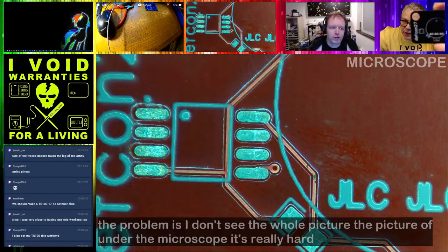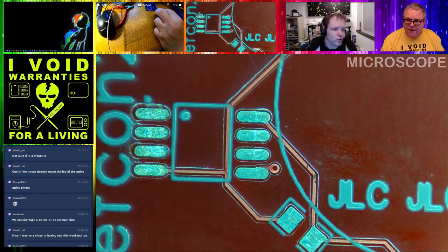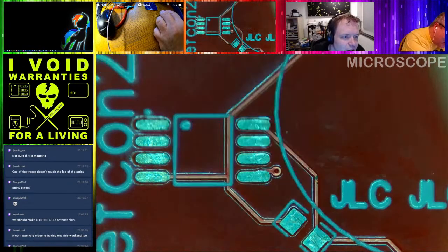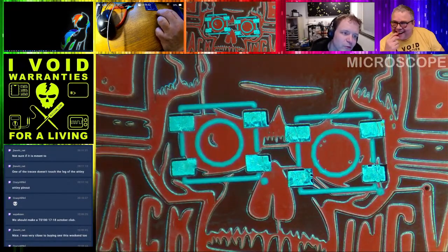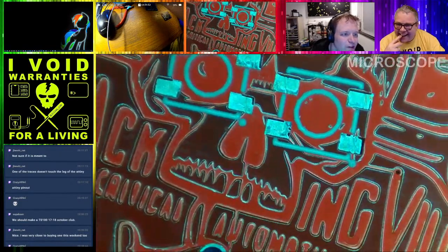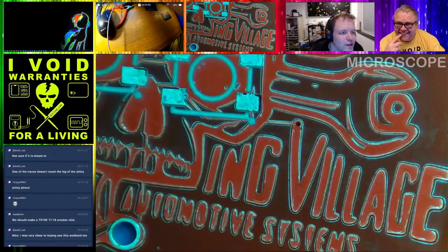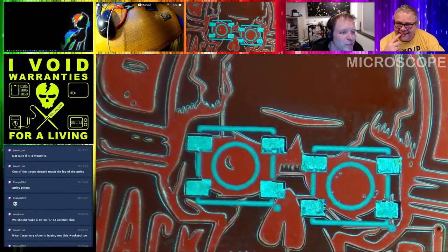So what I suggest, Jilles, is that you just stick one of them in an envelope to me. No, I already figured it out. Let me show you the other side then. Oh, they probably messed up something with the artwork. Those buttons or LEDs don't work because they're all connected to the same thing. That won't work. It's beautiful artwork though. It is, but they forgot to isolate the art from the pads.